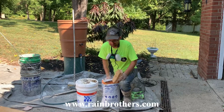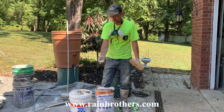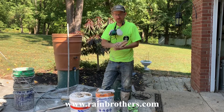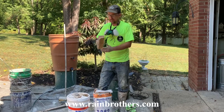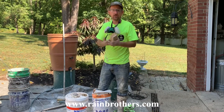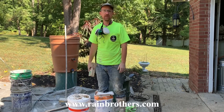Day one, we do a very light coat of Master Seal 581. Our preferred method is to use white Master Seal — it's a white powder that applies white. Get it to a paint-like consistency and brush it on using a deck brush like this. Just coat the first coat on the wall very thin, just like paint, but work it in with broad brush strokes using circular motions to work it into the concrete. Once you do that, you'll have a very good surface for the next coat to bind to.